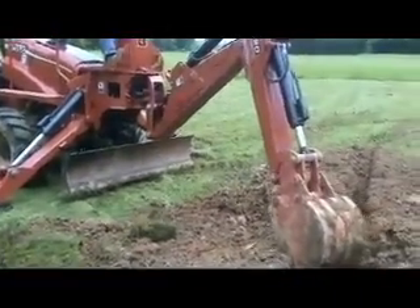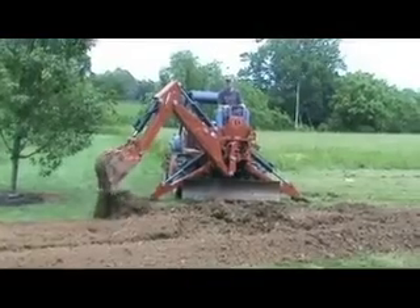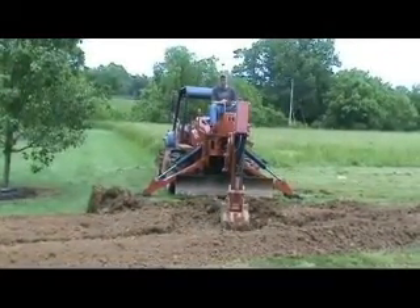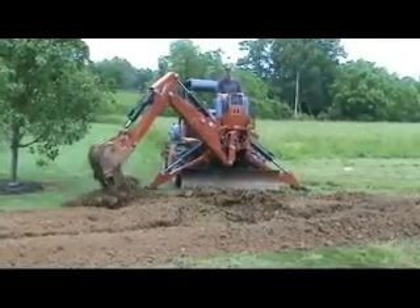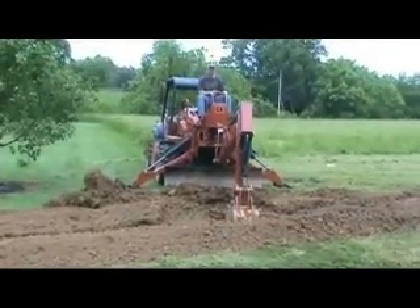The recommended distance between chain trenches is 8 to 10 feet. This is a recommended minimum — the more spread out they are, the better they can perform for you. Chain trenchers prefer long, straight, parallel runs and do best on flatter ground, but they can work up and down hills.